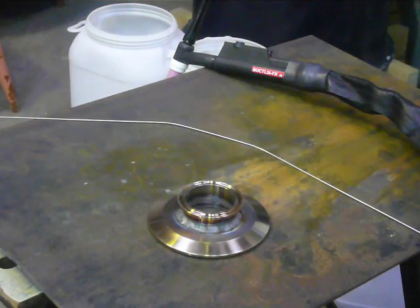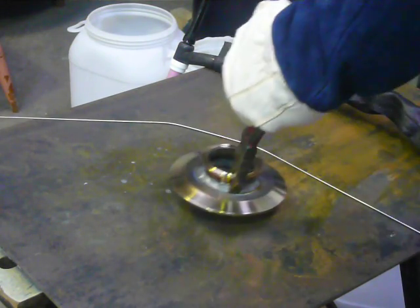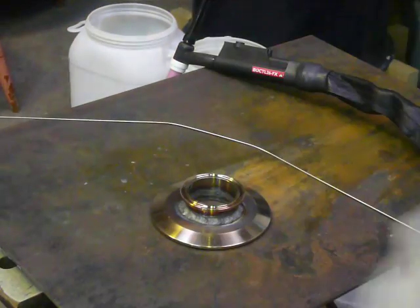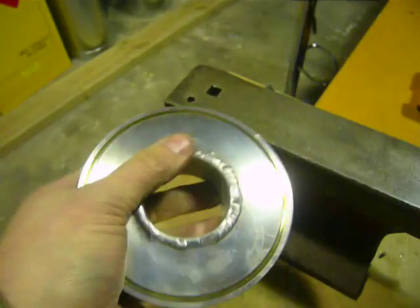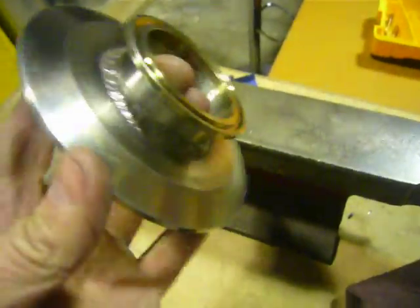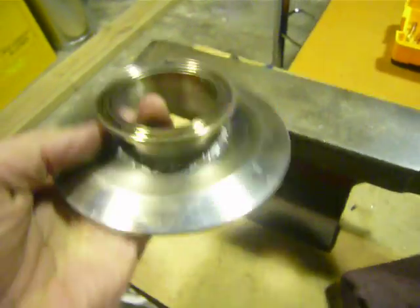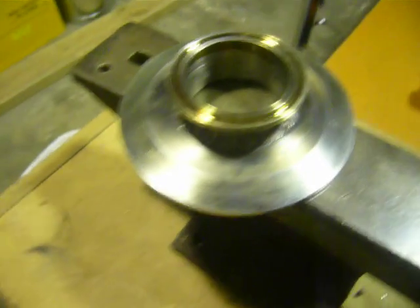And that'll take the weight of the column onto there, so I can run this off my existing kettle with the 4-inch ferrule at the top of it. I've just burnished it up and ground that edge in there. Make it a bit smoother and polished a bit with some steel wool. Ideally I would have liked to have pickled it, that would have brought it up really bright.